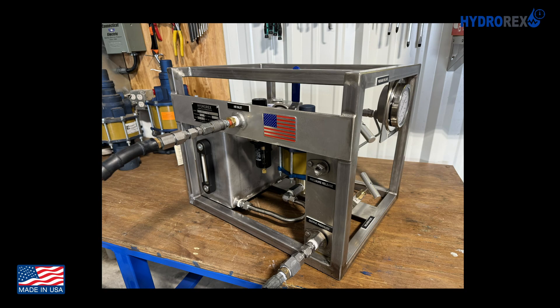This equipment is designed only for injecting pressure and not for filling. So before activating this equipment, the object to be tested must already be filled with liquid. If the object is small volume, no more than 3 liters, then it does not need to be filled.